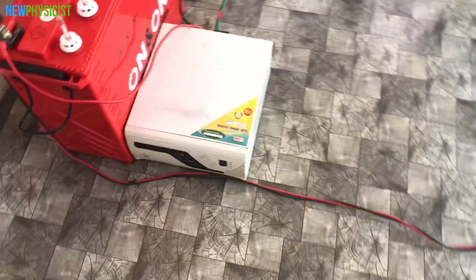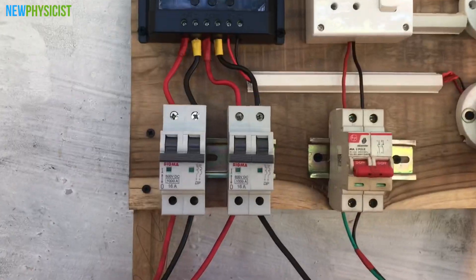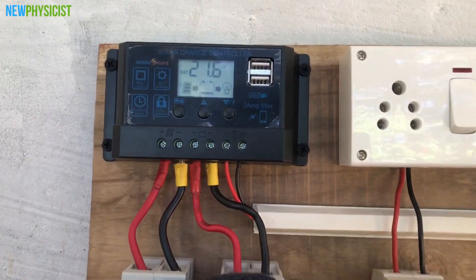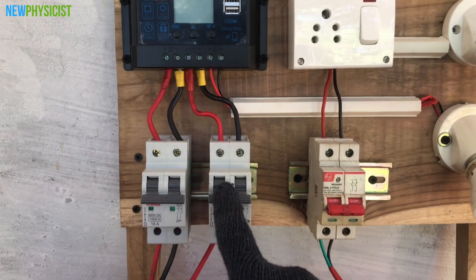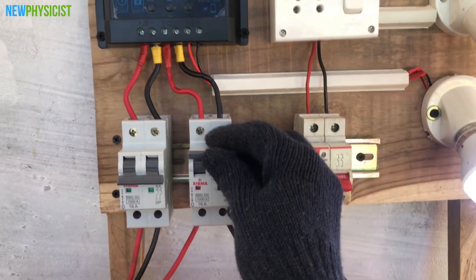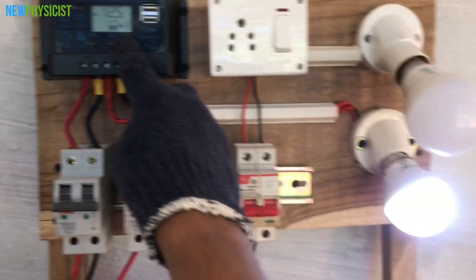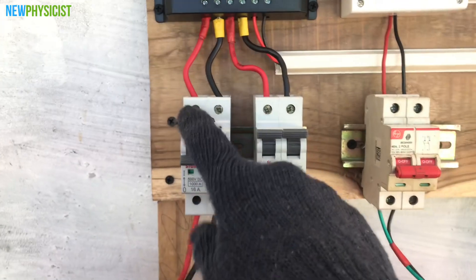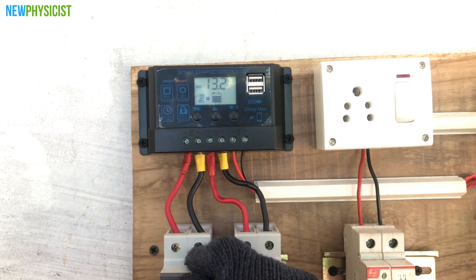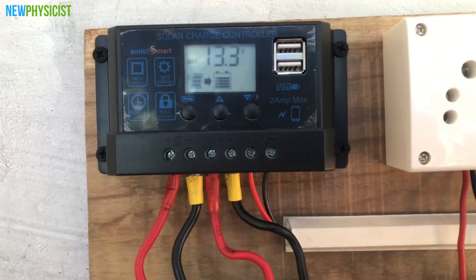The sun is shining bright and the solar panels have already started producing power, but the MCB blocks the power from reaching the charge controller and battery. Turn on the first MCB and check the solar panel array voltage — we're getting 21.6V. Now turn on the second MCB between the battery and the charge controller. When turning on an off-grid solar power system, always turn on the battery first so the charge controller can identify the battery voltage. The battery is new so it already reads 12.5V. Then you can turn on the solar panel. If you turn on the battery while the solar panel is already connected, the charge controller will malfunction. You can see the battery voltage is rising, which means the solar array has started charging the battery.